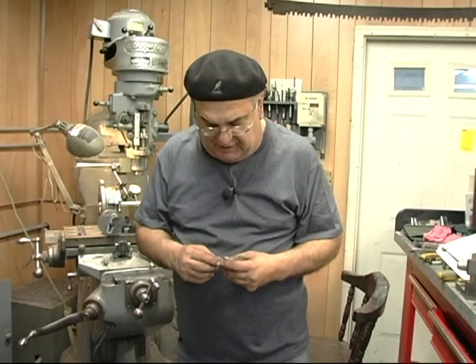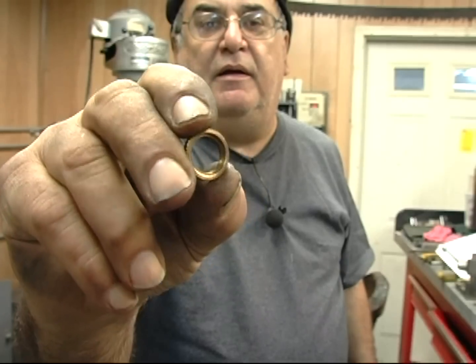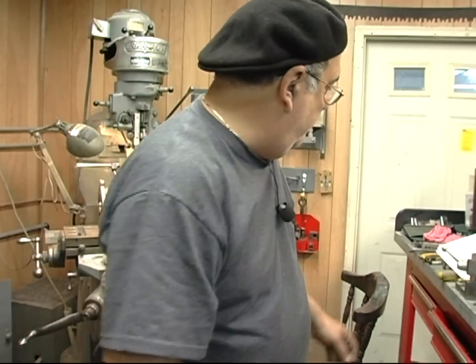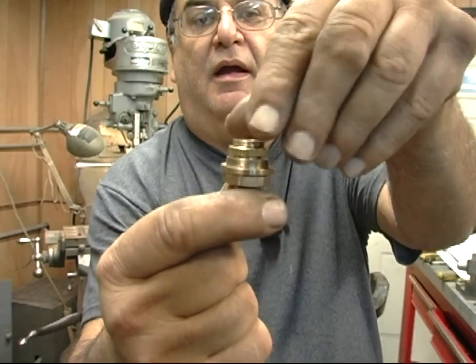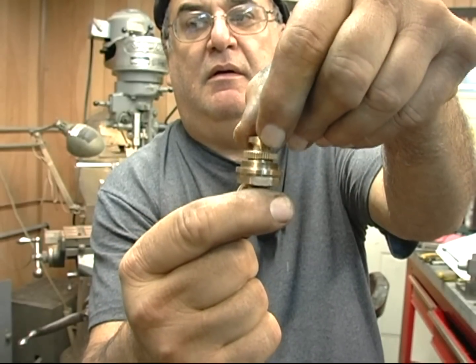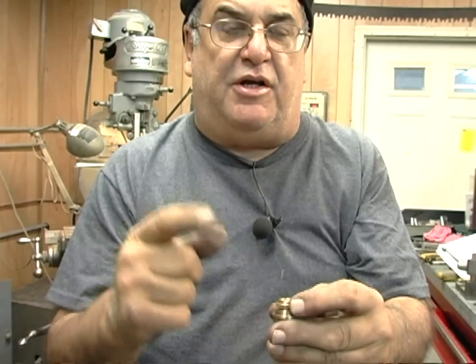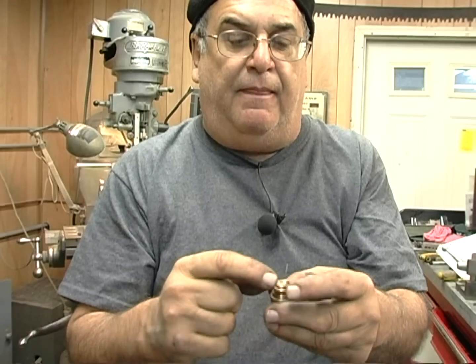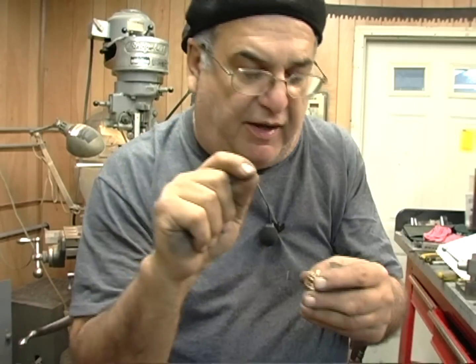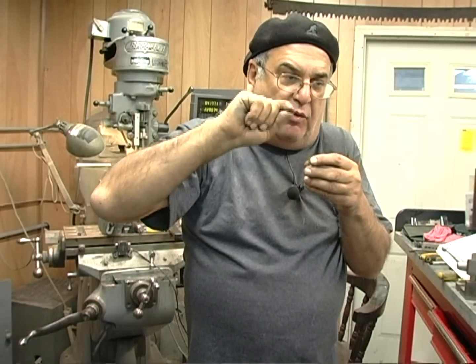I've been talking about safety valves. I've been working on them the last couple of days and what I've discovered is that the blowdown ring, which is this little tiny ring here, is not fitted tight enough to the valve seat. Here's one here all put together. And this ring is adjustable for the blowdown. It's also important for the popping. If you lower it down and get right on the edge of that ready to pop, it won't pop like a pop.